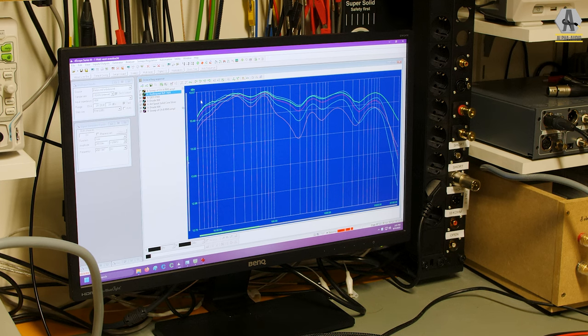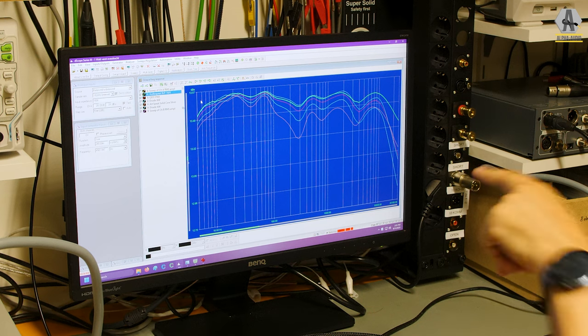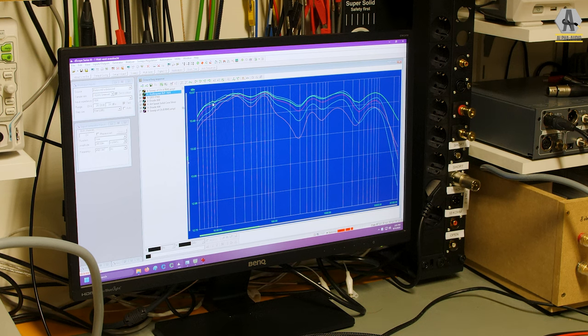If you look at frequency response, I'm not talking about phase or shielding or anything else, but purely at frequency response, the AudioQuest is the most stable one in this bunch. I'm not picking any winners in this test, because it's useless to talk about winning this competition, because we only looked at one element. But I wanted to show you that there are differences in cables, and I think this graph actually proves that.